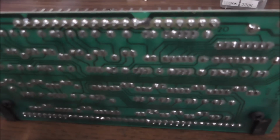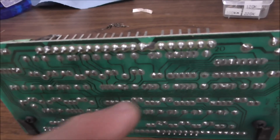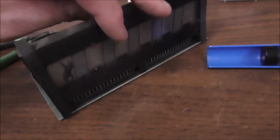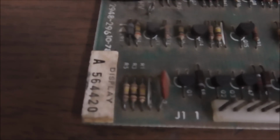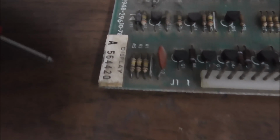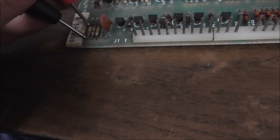So it's the same story. You get cracked solder joints, right? But we've got a little different thing going on with the resistors. So the last digit is the one that doesn't work. So if you look at the resistors, they all look fine. But they're quarter watt resistors. They're undersized. So R1, R3, R5, if you test them, you get something like...